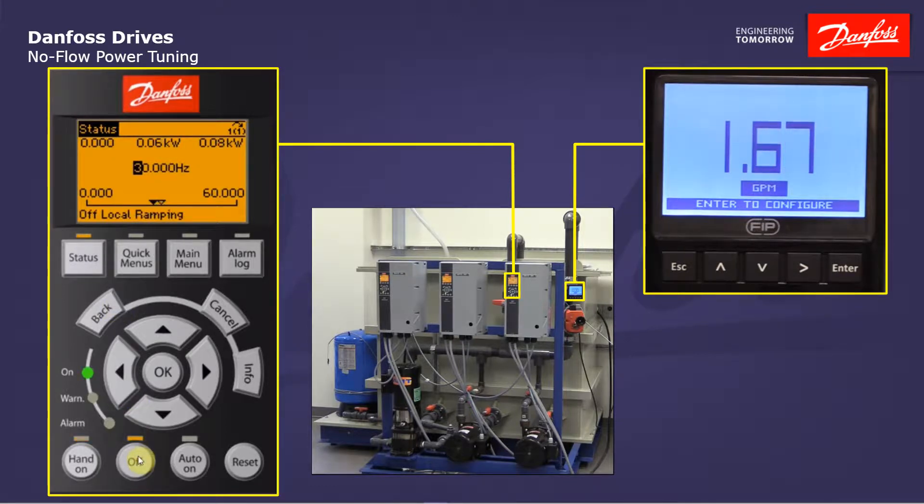Finally, I'm going to stop the drive and completely close the discharge valve to create the no-flow situation and we'll test one last time. The valve has been closed. Start the drive — we'll ramp to 55 hertz. Here you can see now we are at that calculated no-flow power, so my delay timer is counting right now, and after a few seconds we have our no-flow alarm. I can reset that alarm and the drive will attempt to restart, but we will get the same result at any speed because we're going to be at that calculated no-flow power. We're at the no-flow power again, so my timer is counting and we're going to end up tripping on the no-flow again.